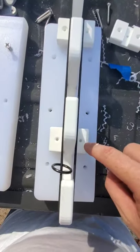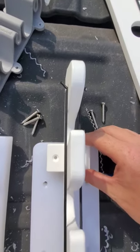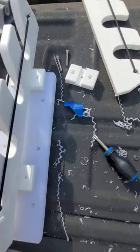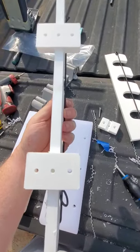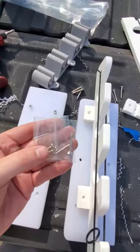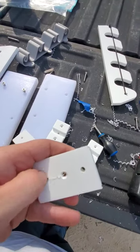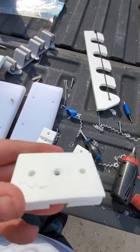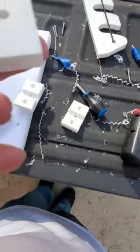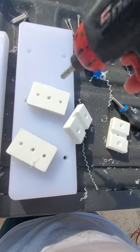Then I got this piece centered between the bolt holes on the bottom, and lined up flush with the top on the other one. Once you get it where you want it, you drill the back — it includes a little screw to attach it there, so you do a little pilot hole and install the screw. I do countersink that little hole because it didn't come countersunk — if you don't countersink it that screw won't sit flush, it'll sit with a hump. I just used a little Harbor Freight countersink right there.